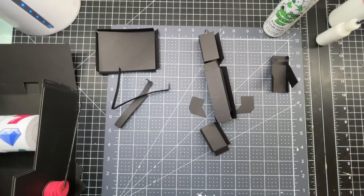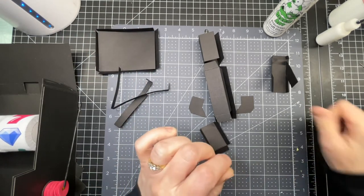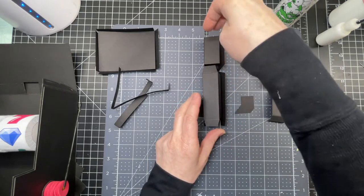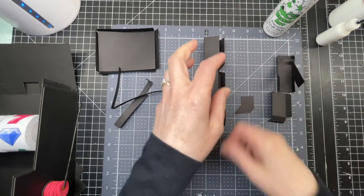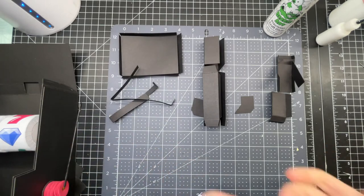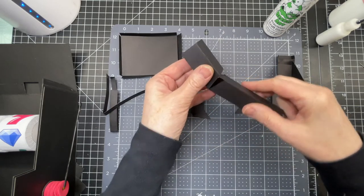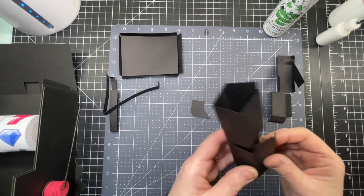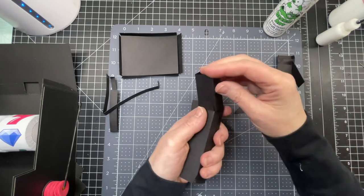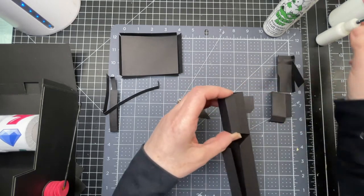Next we're going to work on the three separate boxes that are geared towards the coin distribution. The first box is for when you put your coin into play. The second box is like a chute to replenish your machine when you've used up all the coins. The third one collects all the coins, and when you win it tosses all the coins to the bottom. Let's start with the longest one — the chute. As opposed to regular boxes where you want the outside to be pretty, I've put all the seams on the outside so there's less for the coins to get caught on as they're heading down the chute.